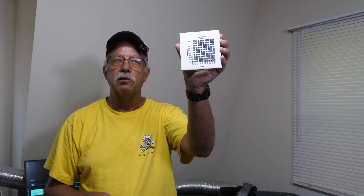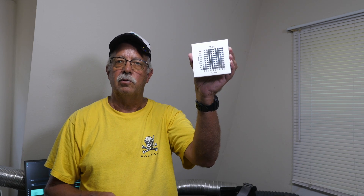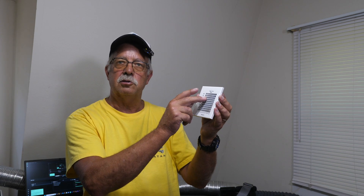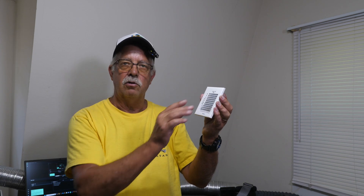Another question I'll get is: what if I don't have a WeCreate Vision laser — either 20-watt or 40-watt — so how do I know what settings to use according to my wattage? They're all different. You need to run a test pattern like this one from the Longer B1. I do this on every one of my lasers. You go through and pick your best speed and power for the darkest engraving. I recently did a video on that and I'll put a link in the description.